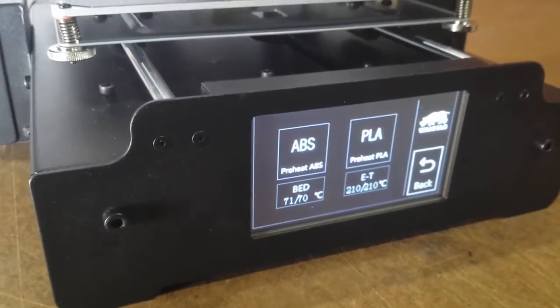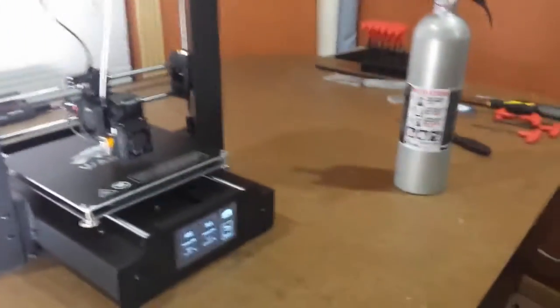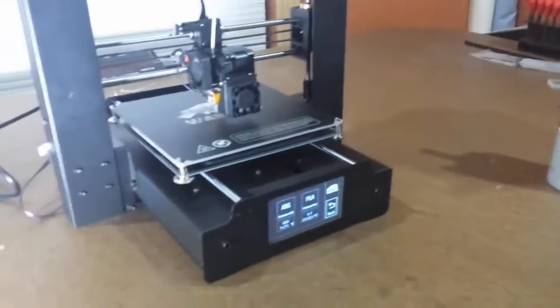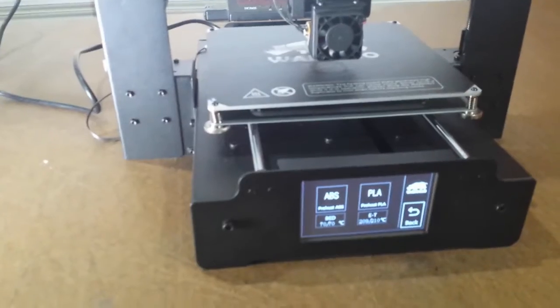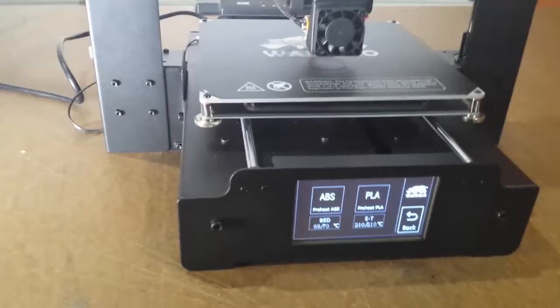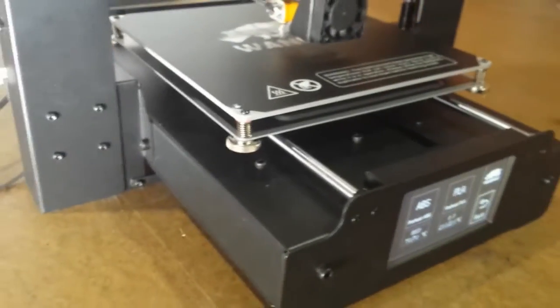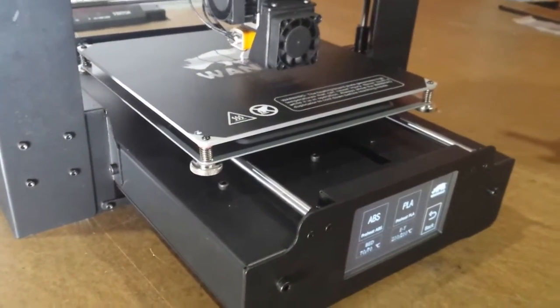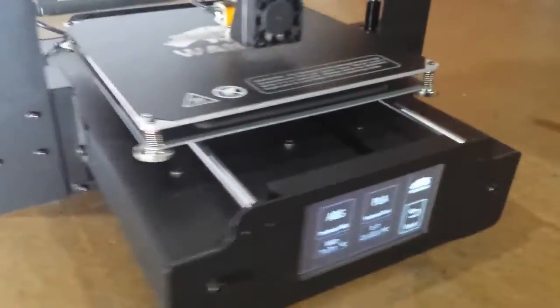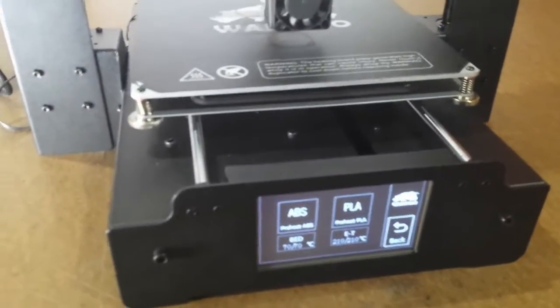That's a 70 degree bed temp after the MOSFET swap. That is most definitely a fire extinguisher — it's called safety — and the printer is also on a power bar just in case, so I don't have to reach around to turn it off. You should be safe when making physical or electrical changes. It is holding at 69 to 70 degrees, so the MOSFET is holding. Whether or not the original would have held, I honestly don't know, and for how long. This one could go up just as easily as the one on board, although I'd hope not given the power it can support.